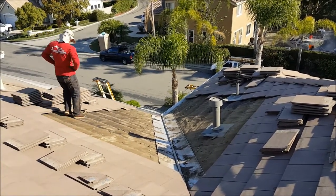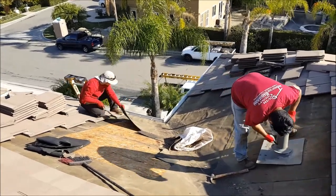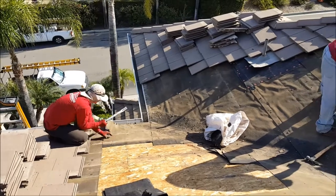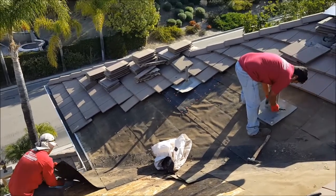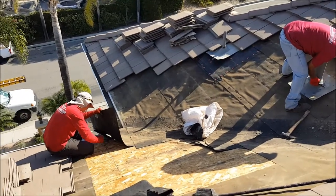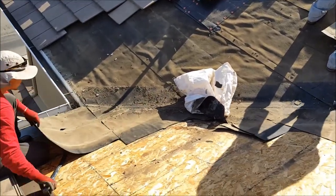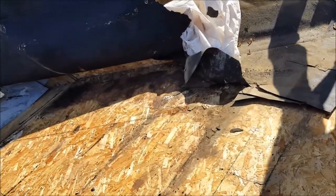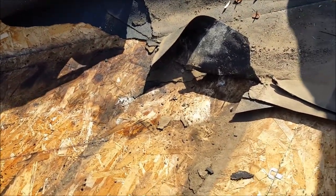We're getting this area torn off. He's removing it, and we're gonna show you one of the number one reasons — other than actually finding the leak — why you want all this stuff removed. A lot of roofers do what they call an overlay: they tear up an area and just put felt straight over it. It's a band-aid and a complete waste of money — it will not last. But here's what we have. Lift that up, let's see what we got. Look what is hiding, lurking underneath your roof. Wow, that is nasty — look at that. That is really, really bad.